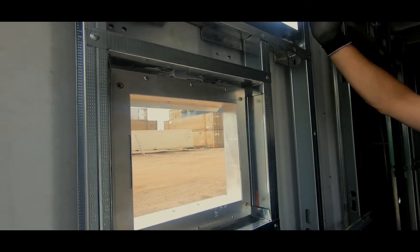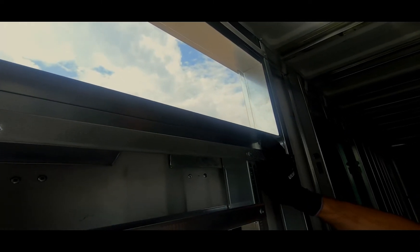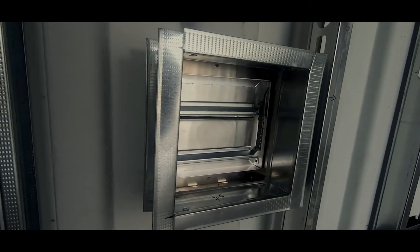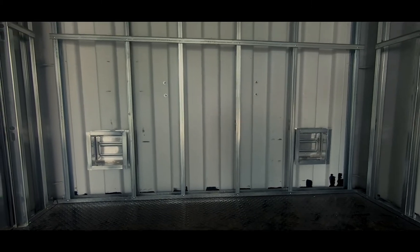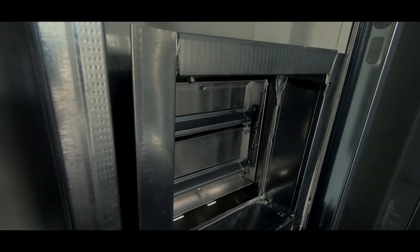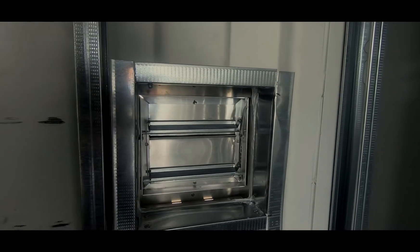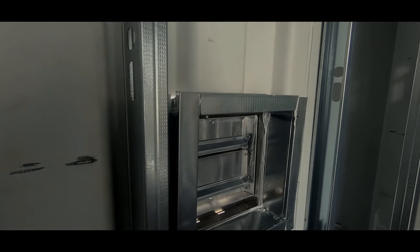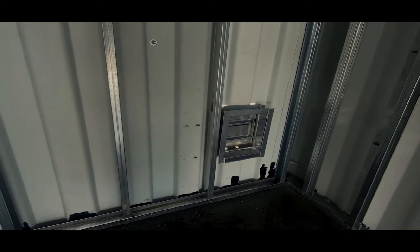Here's the custom frame that we built. We will be insulating all around with plywood and drywall right up to it, and we have a galvanized interior flashing that'll clean this up nicely. This here is our eight-inch intake damper. We're going to be using two of these intake dampers on the end wall of the container. These will provide air to the T10 exhaust vent when it calls for it, but they will close up and not ventilate the container until needed. In the wintertime you won't need to add extra heat and worry about passive ventilating the unit.